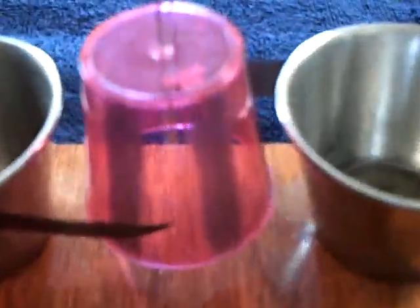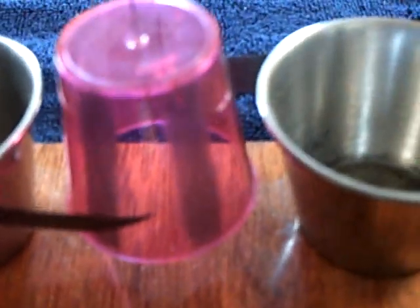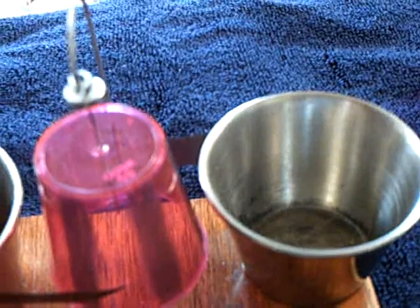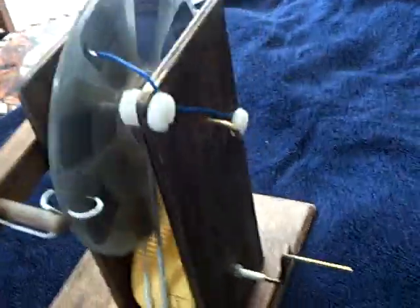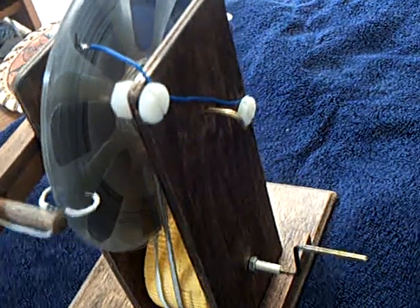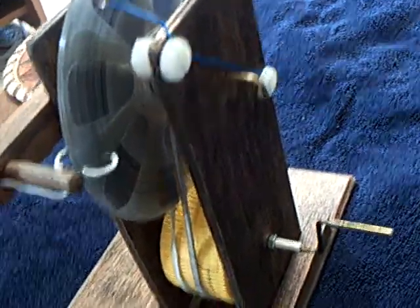I made a rotor here with a very thin coating of graphite for the segments. The brushes are made out of cellophane tape with the graphite powder on the sticky side, just stuck on these little bowls. It worked extremely well and was very easy. I think we could do the same thing on Wimshurst machines and all these electrostatic machines — get away from the aluminum and the brushes that tear it up, and go to graphite brushes and graphite segments.